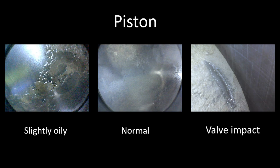The oily film on the left picture — I see that in quite a few cylinders. I don't get too concerned about it unless we have high oil consumption. If you have high oil consumption and you're trying to narrow it down and you don't have an external leak somewhere, then maybe you start looking at things like oil residue inside the cylinder on a piston and suspect that it might be an indication of burning oil. But if it's not using oil, there's no reason to really get worried about it.